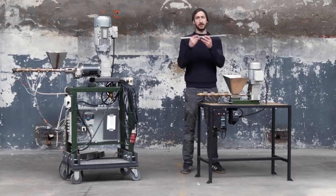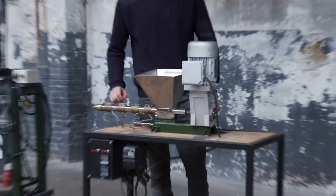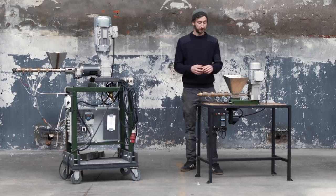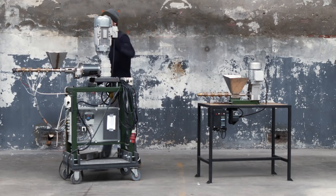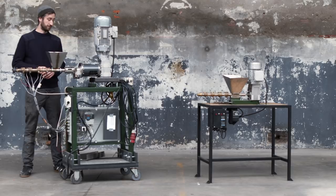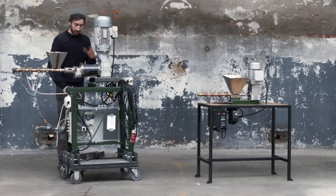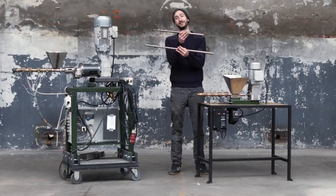For the extruder, a screw moves and transports plastic from one end to the other while it heats up and comes out molten. We already had an extruder — a good starting point — but the output wasn't high enough and it wasn't made to run all day. We built a new prototype: a beefed-up version with a bigger motor, more solid build, and added sensors for temperature and pressure to fully understand the machine. In the end we increased the screw diameter significantly, giving a much bigger output.